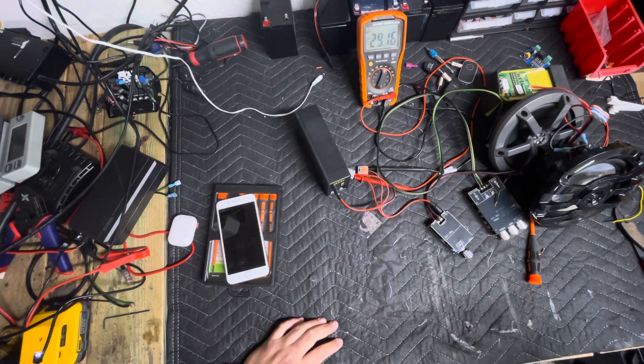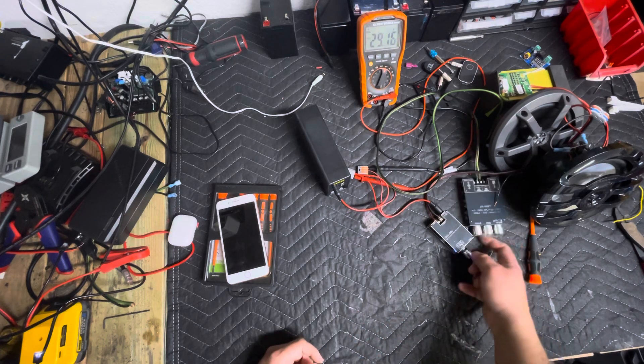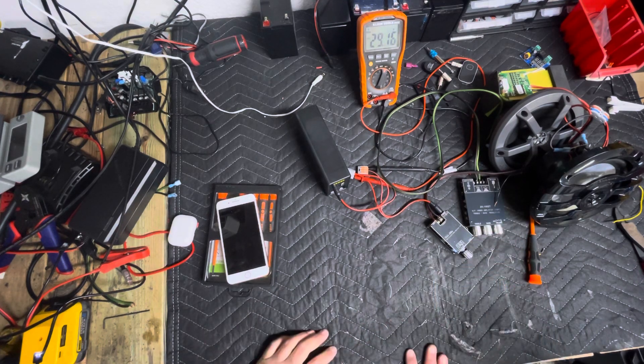The 1002L was fine too — the single knob models were able to handle it. It was the ones with the EQ on them that could not handle 29 volts. So there you have it guys, a little bit of information for y'all. It's been a while since I've done troubleshooting videos like this and hopefully you're all able to follow along. I'm also going to be doing a full build video — it'll be a several-part series to show y'all how to build these. Thanks for watching and have a great day.